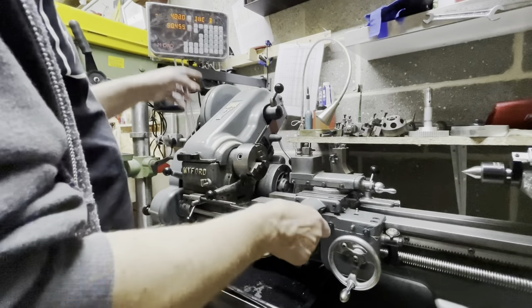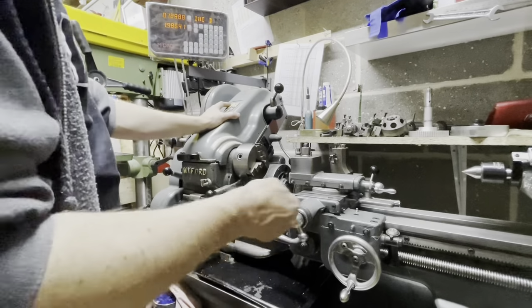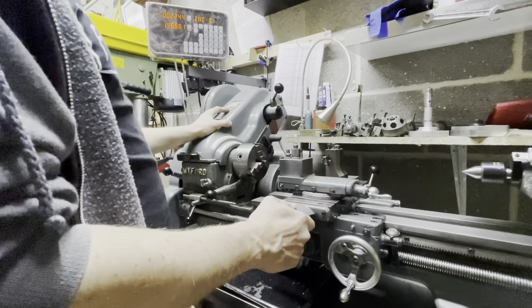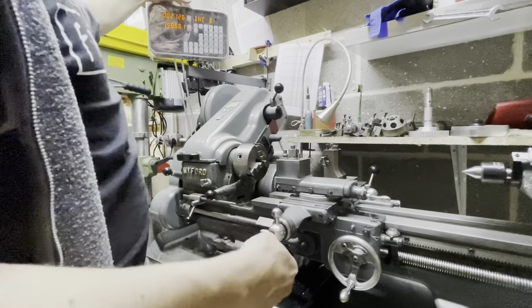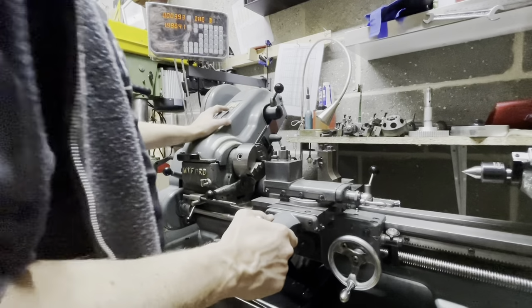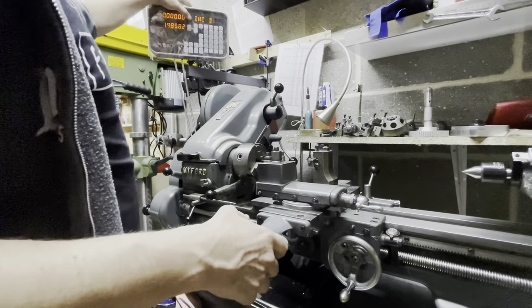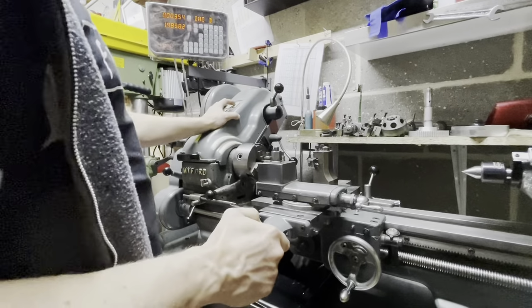So let's use the DRO. I have 6 thou, 22 thou, 23, 22 and a half, 22. Oh, it gets a bit stiff out the back here, so it tells me it's much better. Yeah, look at that. 10 thou, and well, right out here, it never gets used out here, but yeah, look at that, almost nothing.